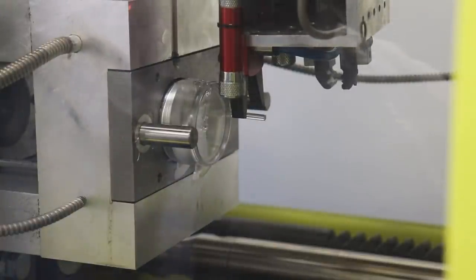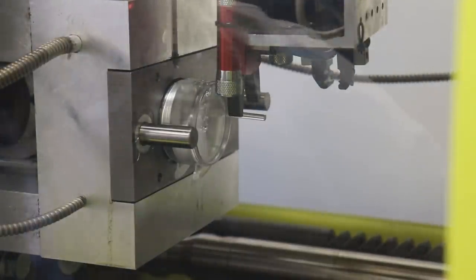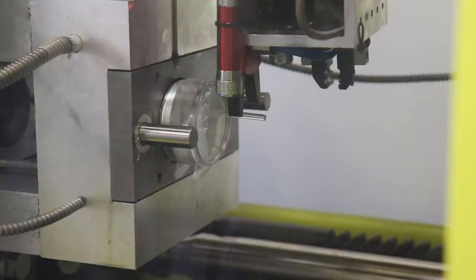You have to watch the entire body of the robot, because all of the arm segments are articulating to make your claw in the right position that you're looking at. And you gotta make sure you're not gonna crash into anything while you're doing this. Okay, so I think I will touch up this location. So on the controller, you can take a previous location, touch it up a little bit, and then literally hit a button called touch up, and it will save the new location.